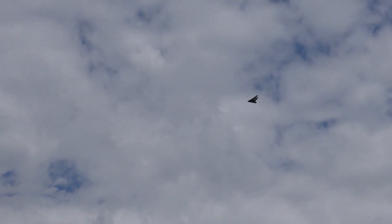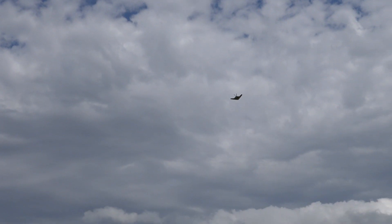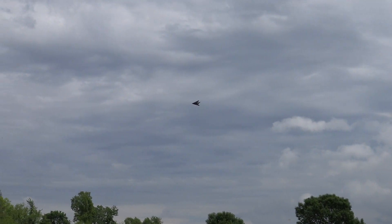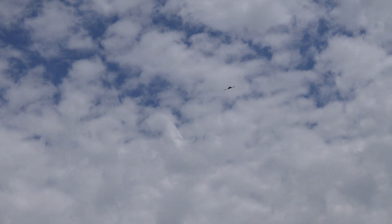Looks like I had a little bit of torque roll on the launch — I didn't really notice that on the first flight. Did you give it more throttle this time? Yeah. It does appear to be not pitching down as much, so I think that's a little closer. Trying another glide test. I may have to give it a couple notches of up elevator. That glide is still going down a bit.